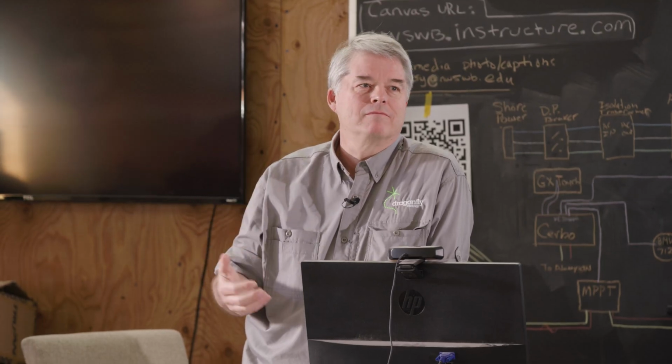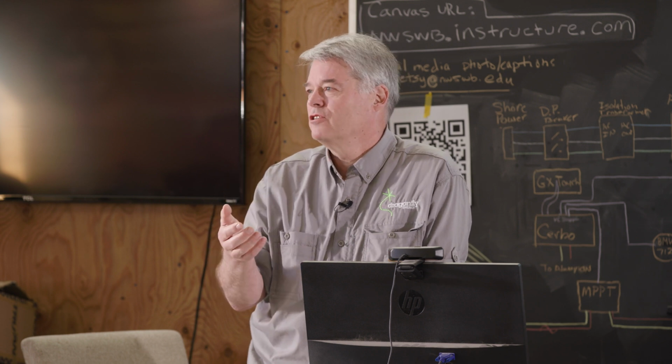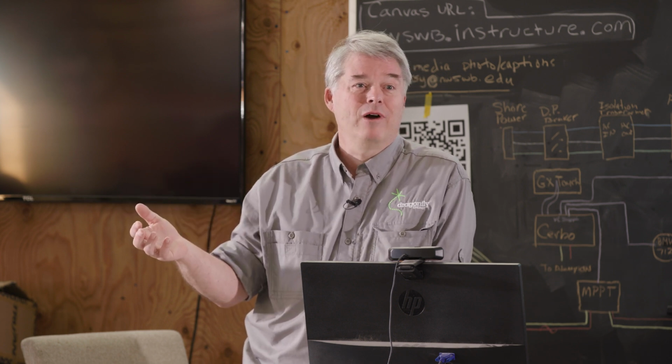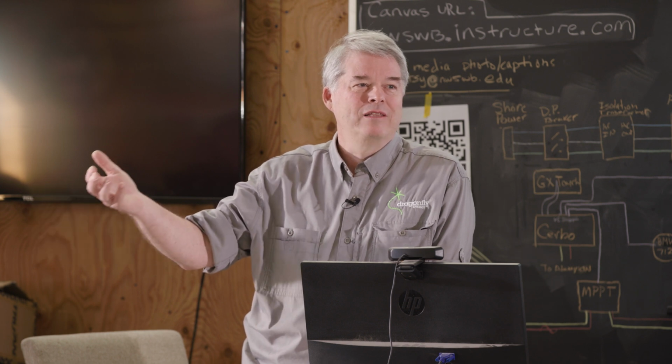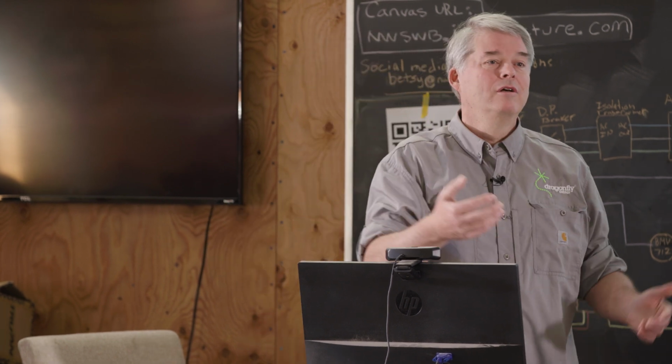Now, the other aspect of that is also what the inverter can take. And I'll be frank with you, this is where you have to just try it and learn, because manufacturers on all sides of every coin lie. I'm sorry, they publish specifications for you to study. On my personal vessel, I've got an AC compressor that I use for the air horn as well as a hookah system. It specifies what the locked rotor is and what the surge is. I also had an inverter that matched that requirement. It doesn't work. I had an inverter from one brand that worked great until it stopped working. Then I went to the glossy magazines and bought an inverter that was highly recommended and met the specifications. It doesn't work, so I had to buy a larger inverter. So unfortunately, there is no definitive way to answer that particular question.